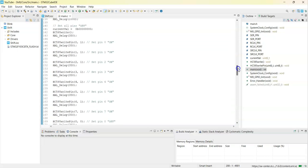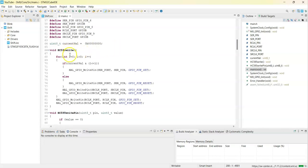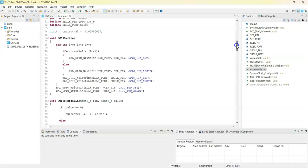Here in User Code 2 we put the value for all pins on — ones — and we call the write function. The write function goes from 1 to 8 and writes each value: it takes the current value, writes the first bit, then shifts. This is the shifting mechanism. For each bit we set SRCLK high then low. We do this eight times, and then finally we lock in by sending the RCLK pin high and low. That's how we write all eight pins.